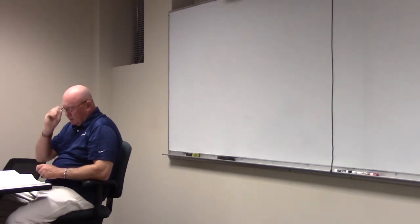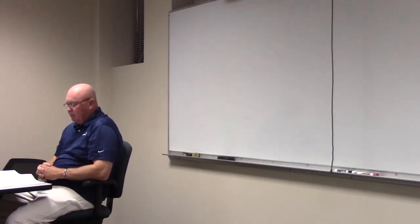So, section 220.82 in your code book tells you that there's an alternate way to do a single family dwelling. So let's look on page 22. And here's all you're doing. Just kind of look at it together. You have a 1,624 square foot house, and you have the following loads, and it lists them there. And here's what you do. Look at step number one. If you notice, we're going to have a lot fewer steps.